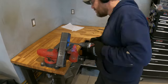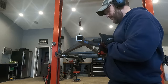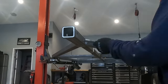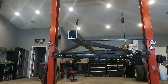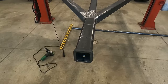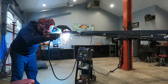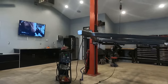While I had the receiver in the vise, I decided to drill a hole through the side of it, and then I drilled a matching hole in the tongue of the trailer. I flipped the receiver back over the tongue, and after lining the holes, I was able to insert a half-inch metal rod. This is a solid piece of metal that will allow a mechanical bond between the receiver and the tongue — and I trust this a little bit more than my weld, although I plan on welding it too. Speaking of welding, I want to cap off the tongue of the trailer before I put the receiver back over it. This should help stop water or dirt from getting inside the trailer frame and corroding it from the inside out.